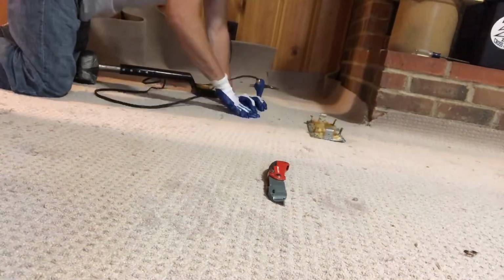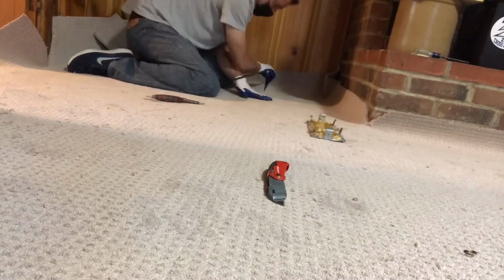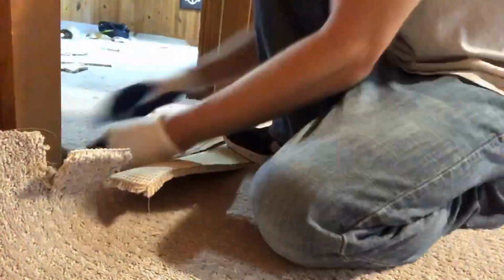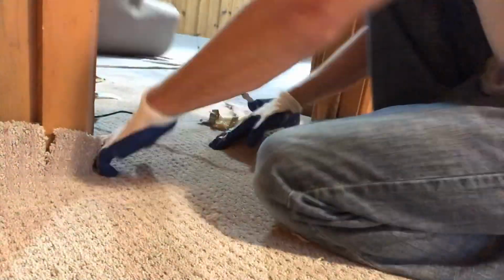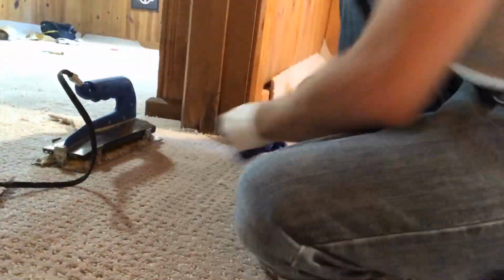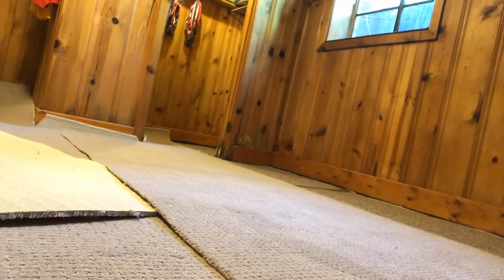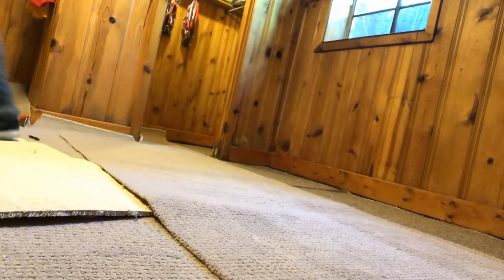Now, if you're wondering what to charge for this, minimum $6 a yard if you are doing it empty, ready to go for the stores. And if you're selling this, you should be getting 12 plus per yard base pay. That's before any removal, any furniture, anything. So stores will try and get you at $3.50, $4.55. I mean, the get-in's got to be at least $6, and you want to try for much more. The reason is it's stressful and it takes time. It's nothing like a nice and easy day full of slop and pop carpet where you just glue and go, kick, kick, kick. Life is good. With this, you actually got to think a little bit.